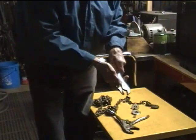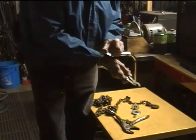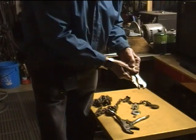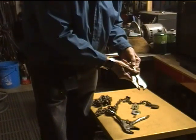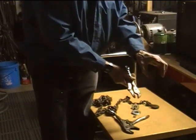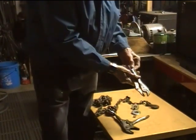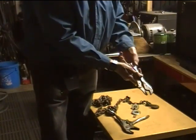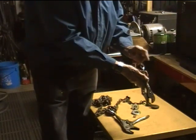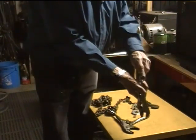You use the clamping pressure of the vice grips to make a gripper. The vertical lifting clamps you find in the heavy construction world are just like a big C-clamp, designed so that the harder you pull, the harder they clamp. This is a little different in that you've got to pre-tighten everything up, but the idea of having this ring here for lifting purposes is just a great thing.